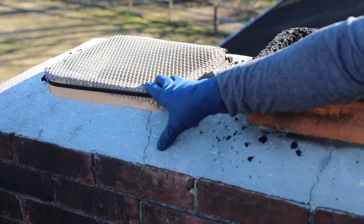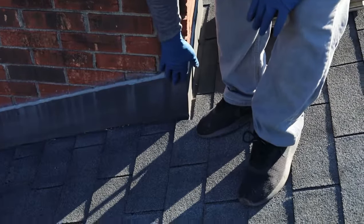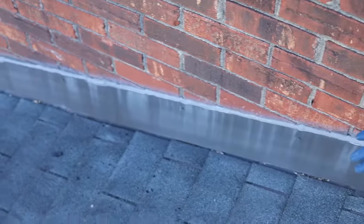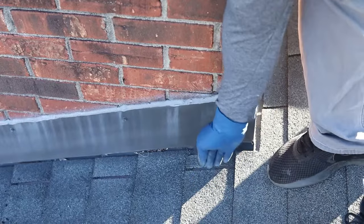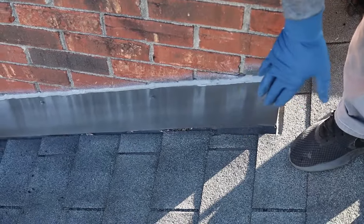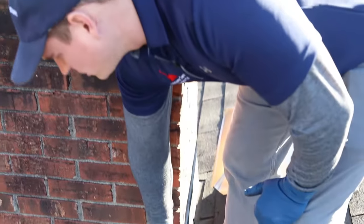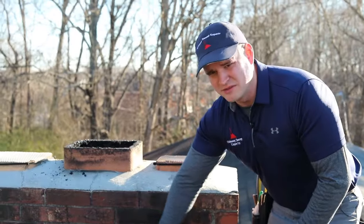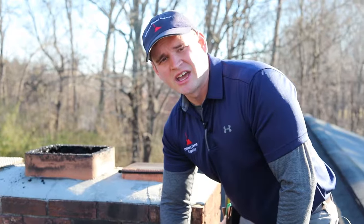As you can see, this one's not used at all. Then here at the bottom, this is a common place of failure — this is called the flashing. What this does is it mends the gap between the chimney and the roof. It's pieces of metal that are actually bent into an L and placed under the shingles, stepping down as it goes along with the shingles. This keeps the water from getting inside the house. When this goes out, you frequently see discoloration in the ceiling, and then the beams and wood around the chimney inside the attic start to get discolored and deteriorate.